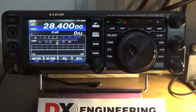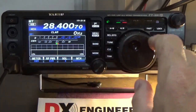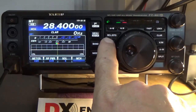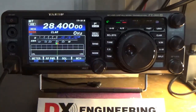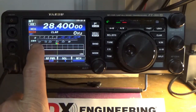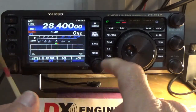Welcome back — part two of the video. What I covered earlier was about the antenna tuner. Here at the radio, this is the antenna tuner and this is the button for it. You dial in a frequency and press the tuner button. I've already programmed this frequency before so it's in memory. If I key down — this is KI5JUF — you'll notice there's no movement on the SWR bar. If you've tuned on a particular frequency it remembers it. Now I'm going to turn off the antenna tuner so you can notice what happens.